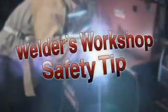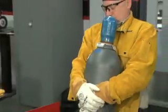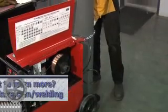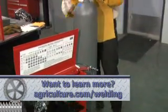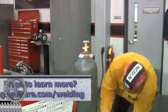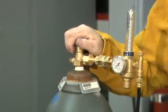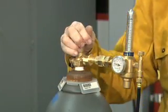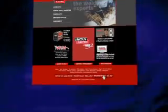Welding is safe when you follow the safety rules. High-pressure cylinders require special handling precautions. Some precautions include: prevent the welding arc from arcing on the cylinder, put the cap on when moving cylinders, secure the cylinders in an upright position and replace the cap when not in use, and return damaged cylinders to the supplier. Refer to the Compressed Gas Association P1 pamphlet and lincolnelectric.com for more safety information.